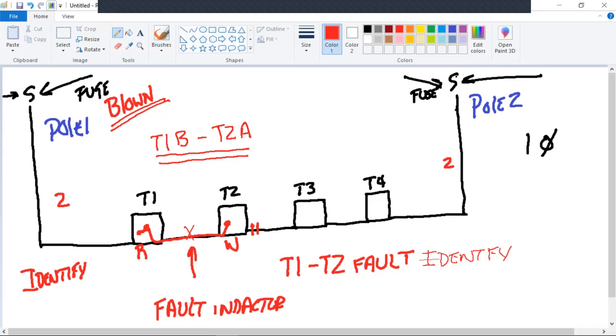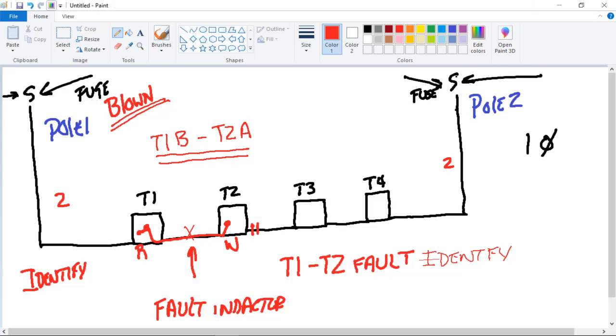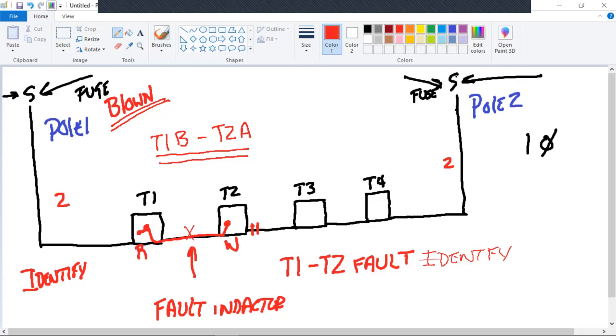The switches on the transformer, I'm glad you brought that up. Both the switches on three phase, primary side, single phase, primary side with a bayonet, or three phase, secondary side, single phase, secondary side, open any of those switches or the bayonet fuses does not stop the flow of primary voltage in and out of the transformer. The only way that you're able to stop the flow or isolate the flow of electricity is to remove the connection, the elbow connection off the transformer. So what do I need to do in T1 and T2? Remove the elbows and move the connection.